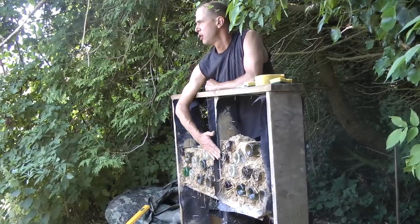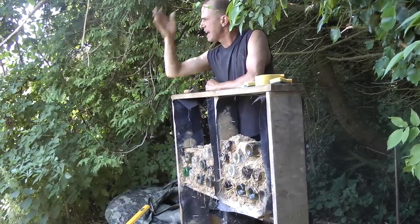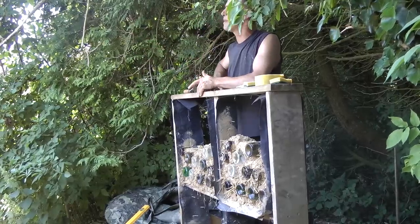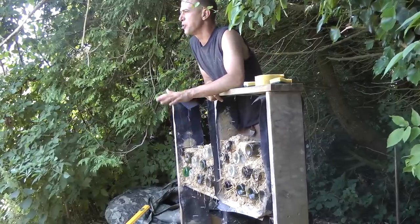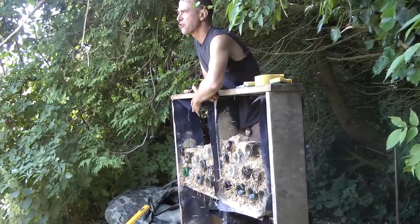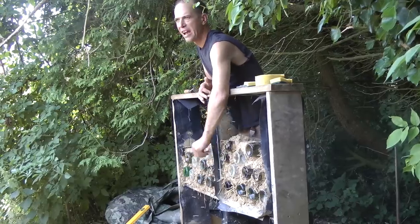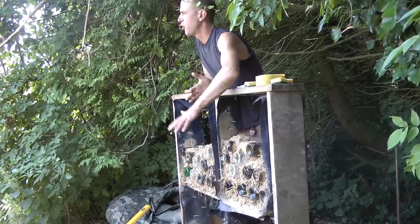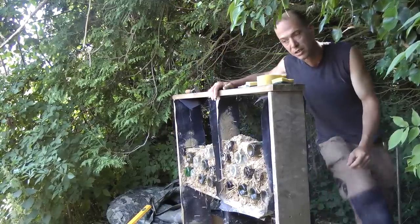This central plus-sign structure will be rendered over so it won't be visible. Equally, you could decide you want the wood to be visible and use the same dimension as the main framework to create a grid pattern of wood with infilled windows. My idea was also that because I've seen some really beautiful bottle walls that combine mosaic work, I would disguise the structure inside by sweeping mosaic in and out of that center with little tiles set in, making an artistic pattern.